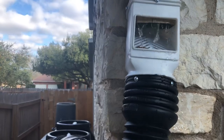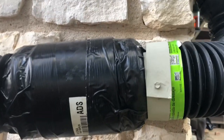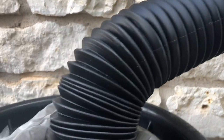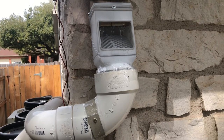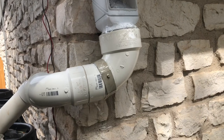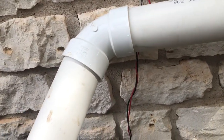The water erupts right through and any leaves or large debris get pushed to the outside. I tried using some black flexible drainage tubing, but I ended up scrapping that idea because it just didn't hold the water weight very well. What I went with in the end was some three inch PVC drainage pipe, and that holds the weight of the water very well. It's just pressed to fit together — no glue was used on this part. On that first elbow I did use a gutter strap to attach the elbow and hold everything securely.